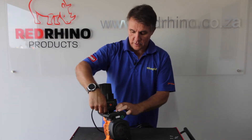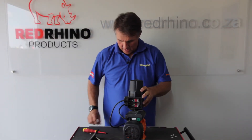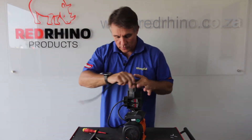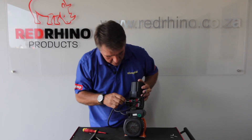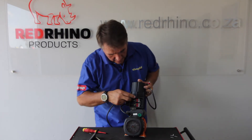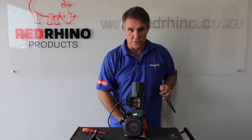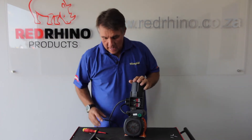Take off the cover of your flow control. You'll first put the wires in on your GPM 60 — you'll see that the connector wires come out of your cap; put the cap on once this is connected. Then take the other end — the bottom one says 'pump' — bring the wires in through and connect them. You've got your live, neutral, and earth connected at the bottom, and at the top you've got your power source going out: live, neutral, and earth. Again, using lugs — don't just use the wire end; it makes for a good connection on your pump and your control unit.